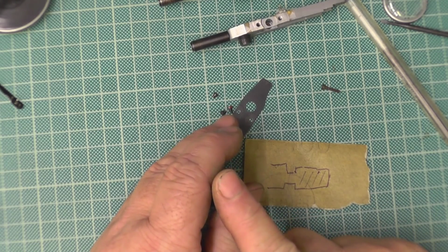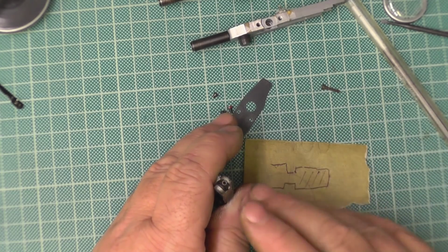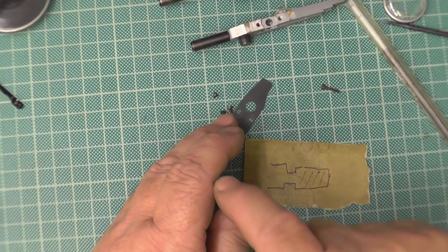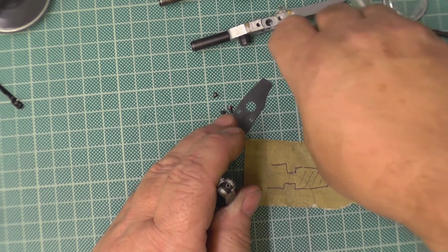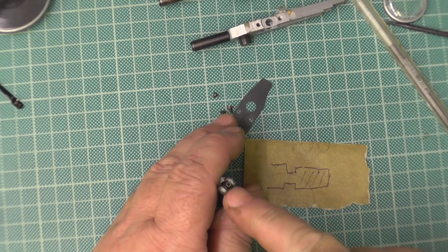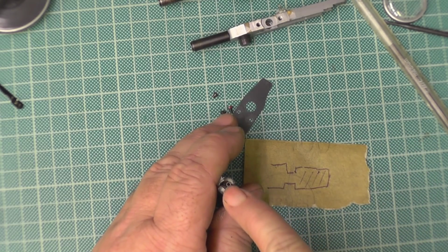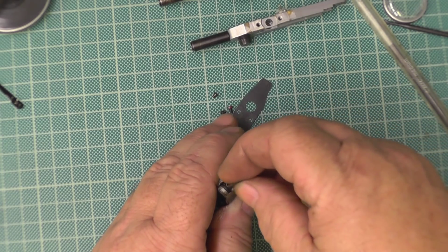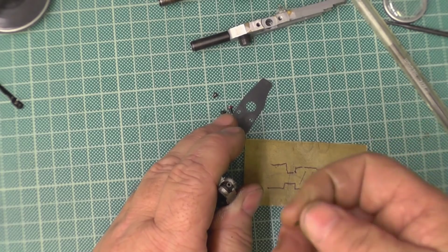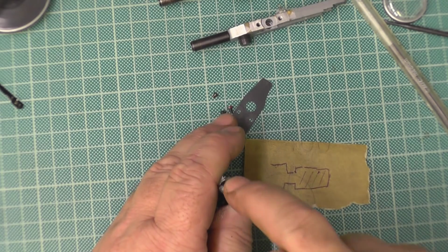The other alternative is to drill it out. Now I have drilled them out. What you've got to do is remove that altogether, take it all to bits, it's only a pivot, and heat it up red hot, then let it cool down slowly, and that makes the pin, what's left of the threaded bit, soft, and also makes this bit soft. So it allows you to drill, and I have done this. On Mad Modders I posted a load of pictures of doing it, and with a little homemade easy out, if you want to call it that, I've screwed the remainder out and then replaced them. Then I've rehardened this bit.